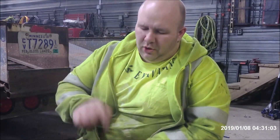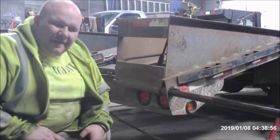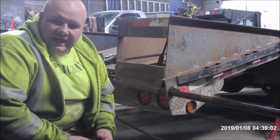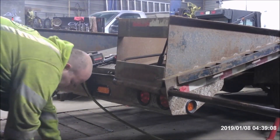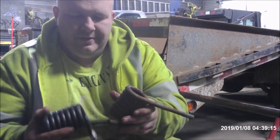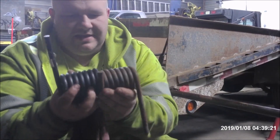While hammering, there's a small tab that a bolt goes through to hold the bar in place. That broke off, so I'm gonna have to get the old welder out and weld a piece back on there so we've got something to pull it out with. Pulling out wasn't so hard in the end. We've got our springs out. Here's the new one and the old one — you can see part of it is broken and it's a little distorted, so we'll get the new one on to make it easier to pick up the ramp.